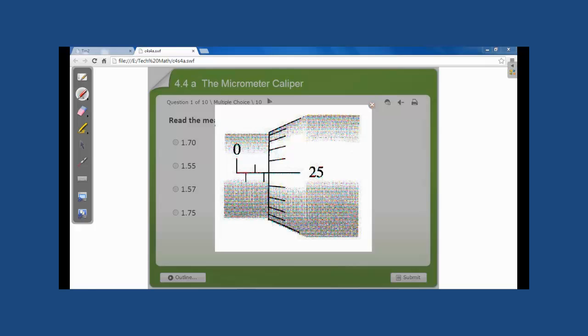As we can see here in this picture, looking at this part of the micrometer, we can count here 1 millimeter, because every line up here represents 1 millimeter. If we look down here, every line represents a 1/2 millimeter. So we can say that we passed also 1/2 millimeter. When we look finally to this line here, we can read 25/100th of a millimeter. Add these numbers, then you will have your reading for this measurement.